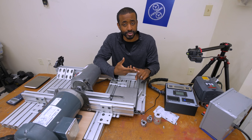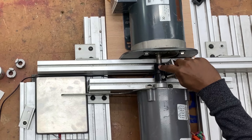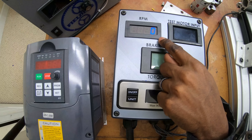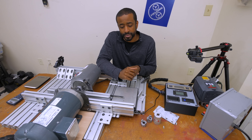I told you earlier that there are two things we need to capture. We need to measure the RPM — that's measured by this sensor right here. There's a magnet which you can see glued to my coupler. As that magnet goes by, the sensor picks it up and displays the RPM. I also need to measure the torque, and this was the more complicated part of the formula.